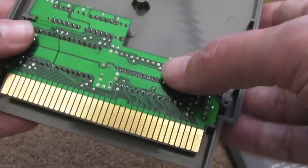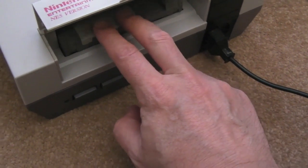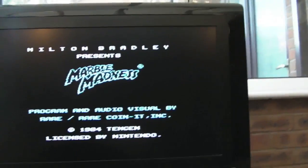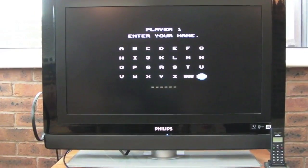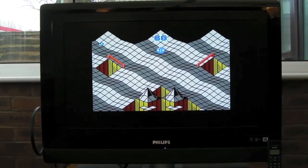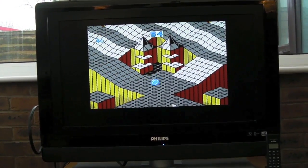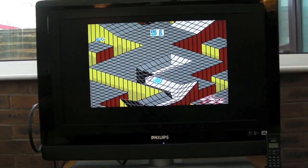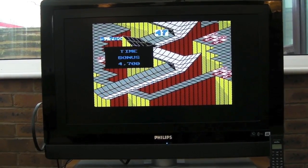There's still a bit of pressure there - I'll use my files to make that perfect. I'll just set the camera up and put this in. It's not screwed together so you've got to be careful. Push it down, switch it on - as you can see, that's working. Moment of truth - let's see if that graphical weirdness has gone away. I'll just hit start... yes, that's looking sweet. So there you go, I've converted that to PAL. It was annoying that I was stupid at the beginning and didn't look at the size of the ROM - just went hurtling off with a 27C256, which would work if you've got a 32K prog, but clearly in this case I had 128K. Excellent - I'm pleased with that.